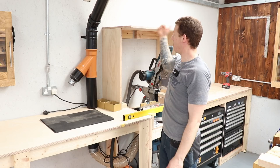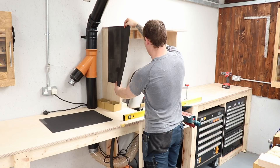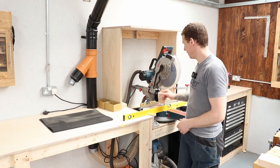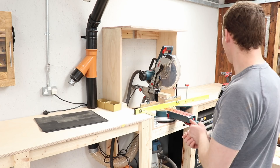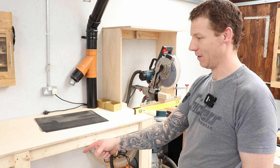The cowl is all finished up. I left the top overhanging the two sides - I have these foam drawer runners from the tool cabinets I'm thinking of stapling on there for a little extra dust protection. They're flexible enough that the saw can just push them out of the way. Both side panels are on, the hose and power cord are running through the side up to the top of the saw. Dust extraction is all hooked up, I'm perfectly level with the top after shimming the saw slightly. The miter saw station is more or less complete.